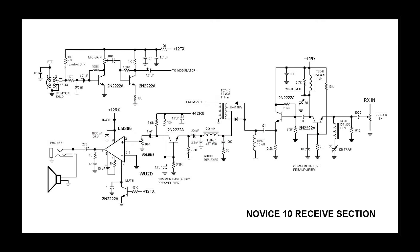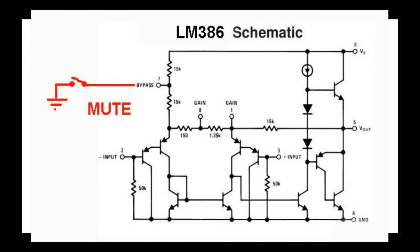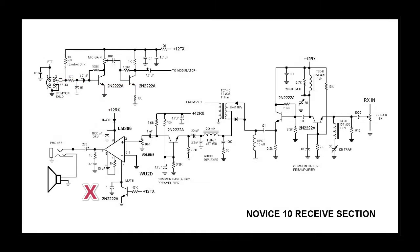That means that with a muting circuit, the large capacitor wouldn't influence the rest of the circuit, and I could cut the 386 off by cleverly shorting out the junction of the feed resistors on the input differential amp. Basically, it takes the voltage at the diff amp to ground, killing power and muting the 386 fairly well. But of course, this costs another 2N2222.